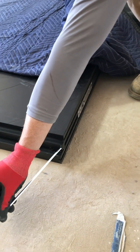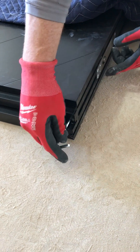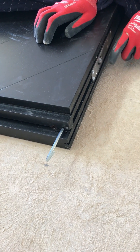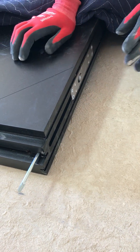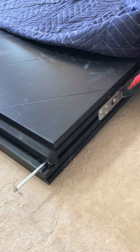This top hole here — we've got another one, and it takes a very long Allen wrench. Turning it counterclockwise or clockwise will actually move this pin position towards or away from your Allen wrench, and that is the main adjustment for this door slab.